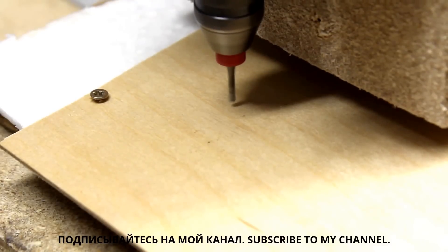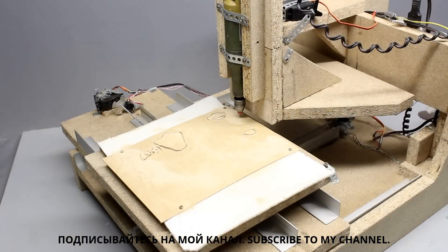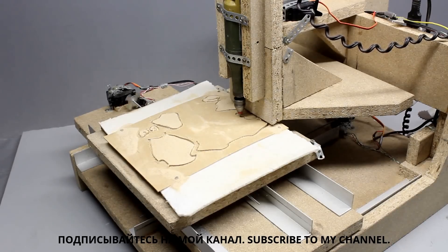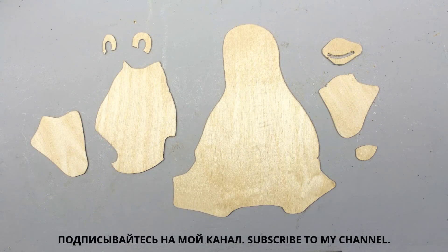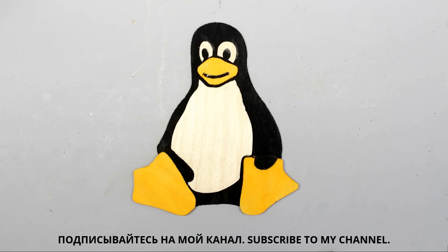The router can cut 1mm plywood more easily, so you can increase the speed of the machine slightly. The parts of the puzzle are mirror inverted because the edges at the bottom of the plywood are cut smoother than those at the top of the plate. Approximately one hour is needed to cut all parts of the puzzle — this is not a speed record breaking CNC machine. When the machine has finished its work, the edges have to be smoothened with sandpaper. Put raw material in and get perfect parts out is nothing you get with cheap machines. With some paint and glue we get a well-known bird — it's highly recommended to rethink your software strategy if you don't know the name of that penguin.